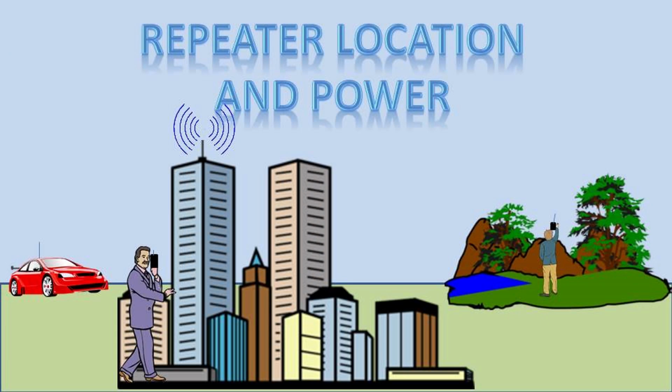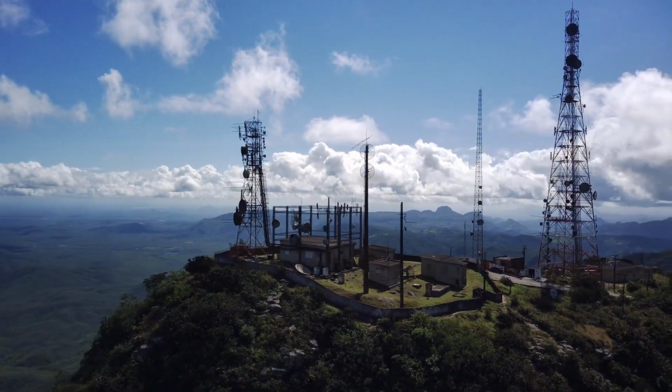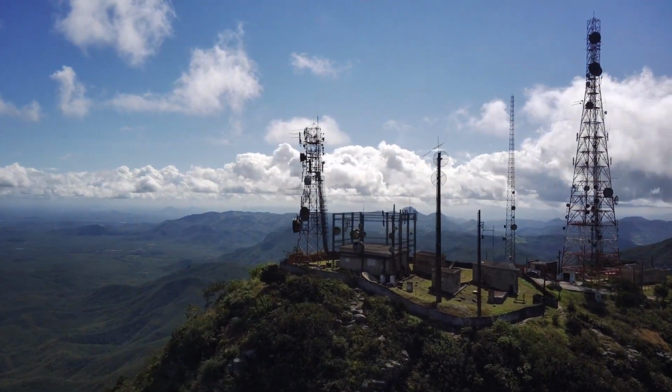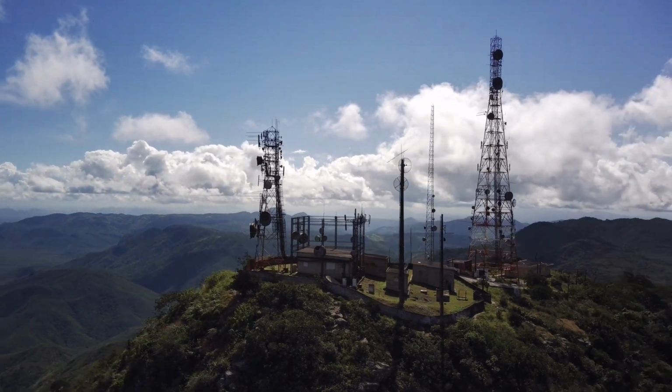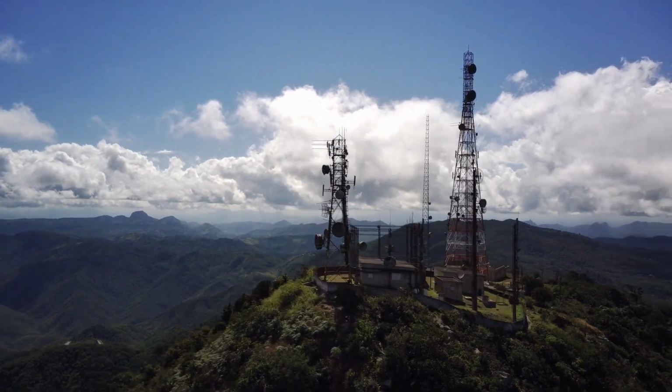The first way is to increase power to the maximum allowed by the regulations. The second way is to raise the height of the antenna. Most repeaters do both of those things. Repeaters often use close to the 50 watts allowed by the regs and are usually placed on high buildings or hilltops. Along with high-quality antennas that allow their receivers to receive low-level signals, repeaters greatly increase your radio's reach. The repeater repeats your call by simultaneously receiving and then rebroadcasting your transmission on the repeater's output frequency at the repeater's higher power level and elevation.